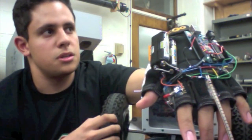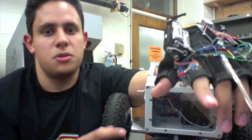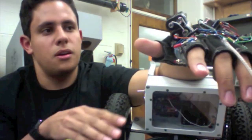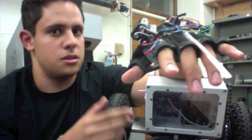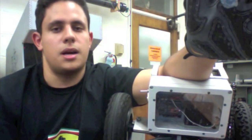the mountain board doesn't keep accessing the same data that was not updated. So if I lost communication with the glove right before it was at full speed, it would keep going — but the semaphore guarantees that that will not happen.